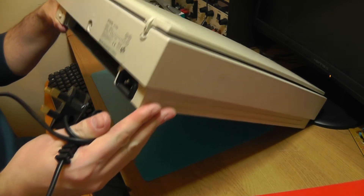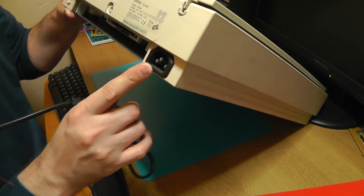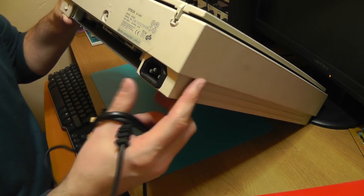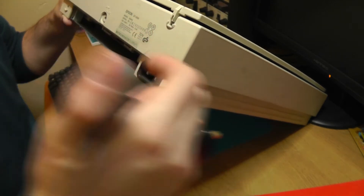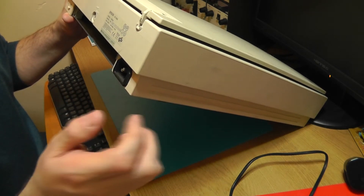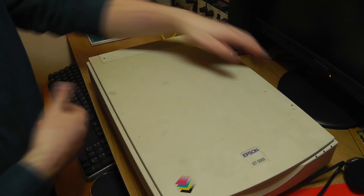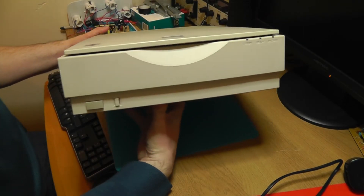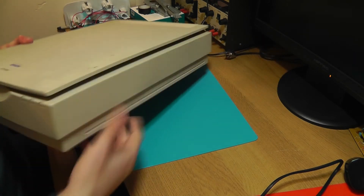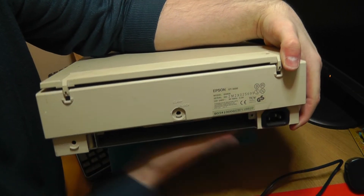What I need to do is take and utilise this - reroute the wiring from this onto the main circuit board and replace this little wire here. It's a much better arrangement. It saves me from hacking the case up as well, as it's already there - saves some time. I'll also drill the fuse holder.